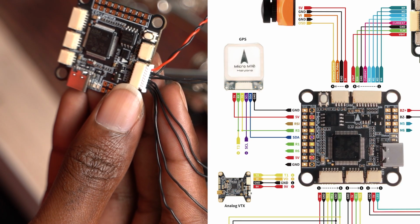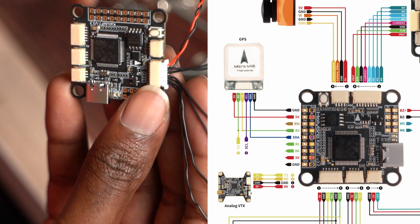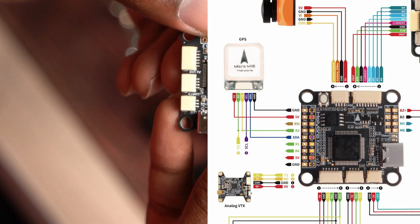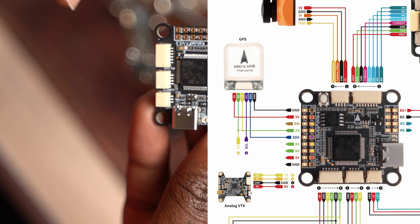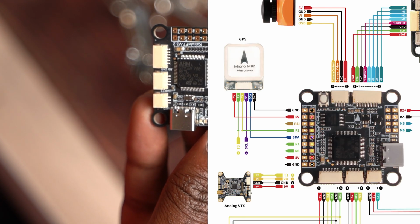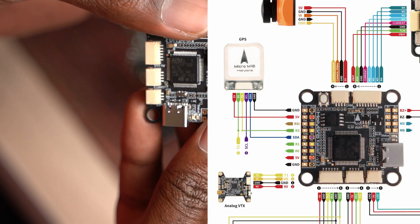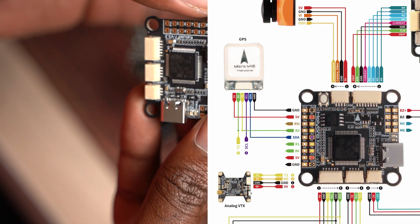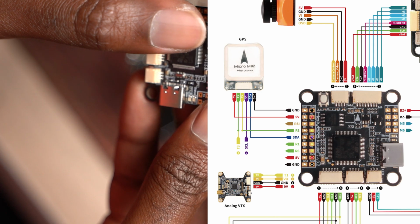But now that I know, I'll tell you to skip the headache. So motor 1, you take a note of that wire, and you can probably twirl the other wires up together, or knot them, or remove them if you want to. I wouldn't. You keep the wire for the servo, and then you'll need some scrap wire for M5 and M6. Well, I needed scrap wire for M5 and M6.